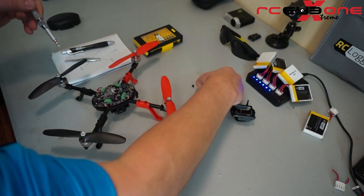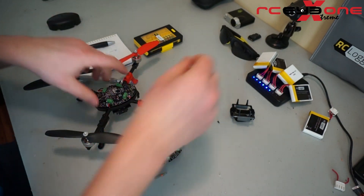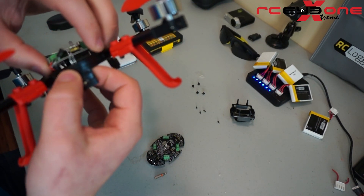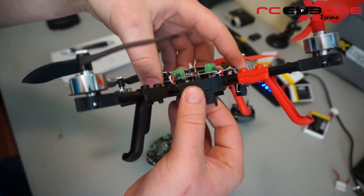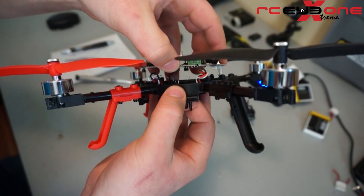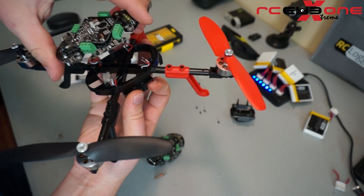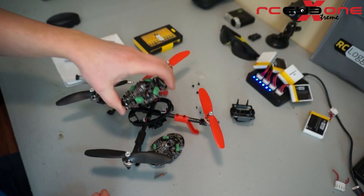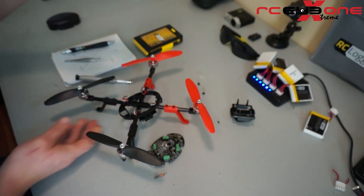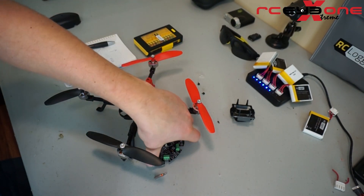Let's take these four screws out. Don't just rip your board off the unit because it is still somewhat connected — there are orientation LEDs that are connected to the main flight control board. To remove them, start at the front and pop that connector up and out, then move to the sides and pop those too. There are just two little prongs on each. Now it's important that you keep your orientation correct. One way to identify you're installing the board the right way is that the battery jack will align with the battery jack receiving slot in the mainframe. Set the old flight controller off to the side so you don't accidentally reinstall it.